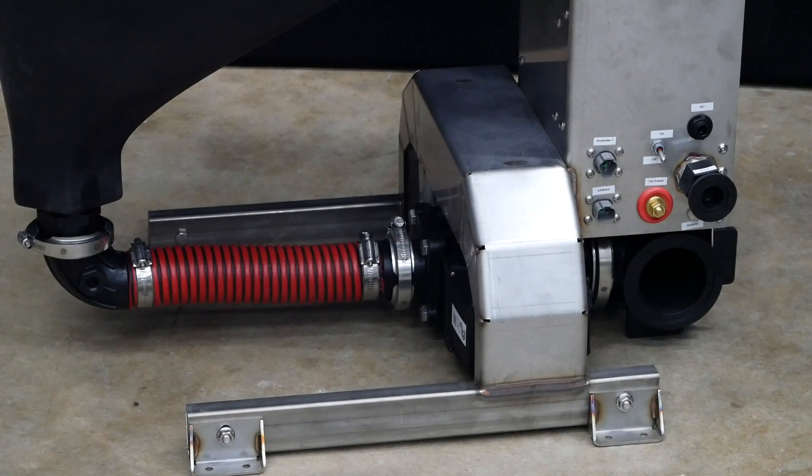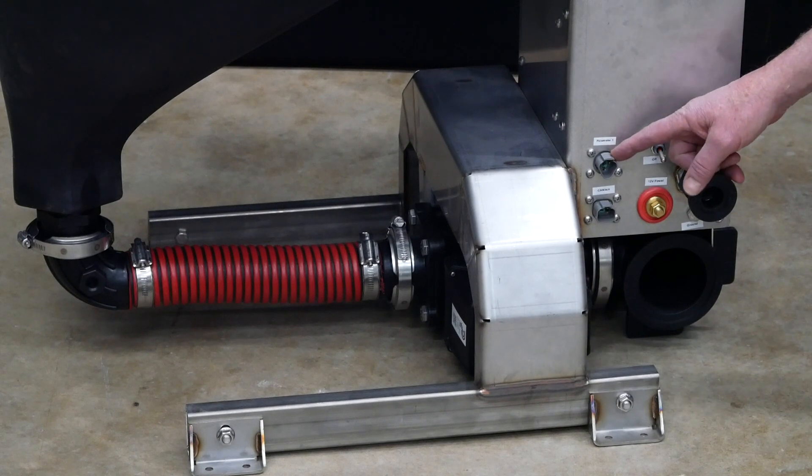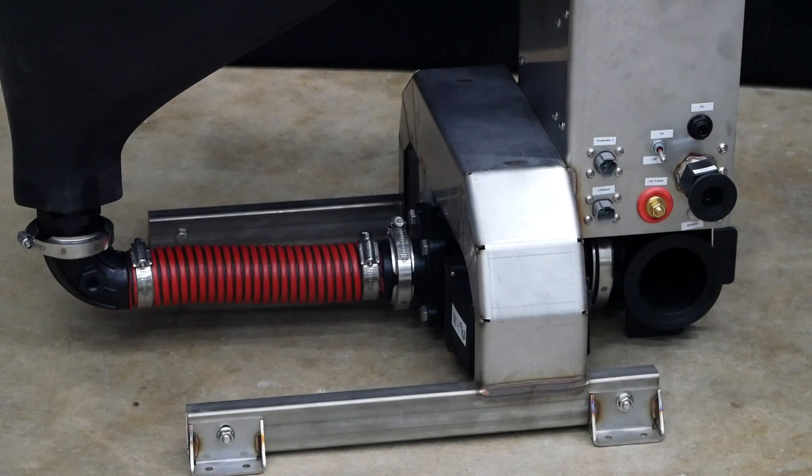Let's take a closer look at the connections near the bottom of our fusion. We have an electrical connector — this is a 3-pin connector labeled Flow Meter 1. It is typically used for your water flow meter or your fertilizer, the large carrier flow meter, typically a 3-inch flow meter. This bottom connector is a CAN bus connector used for expansion of our system, plugged into external components.